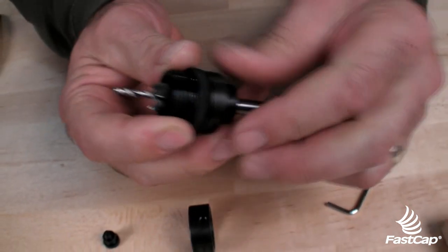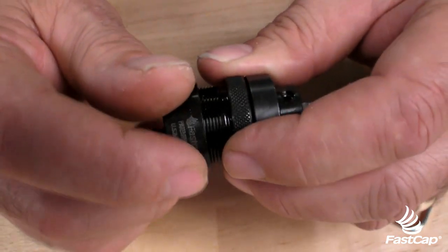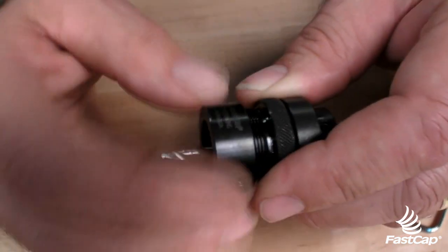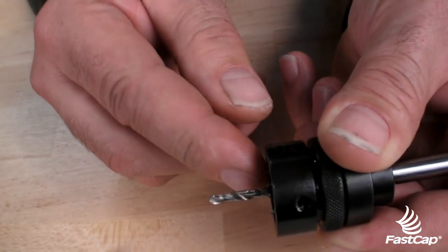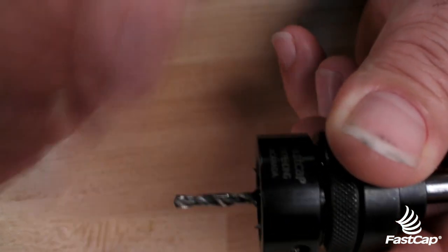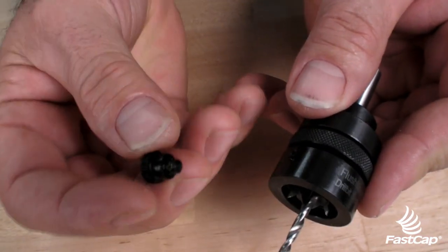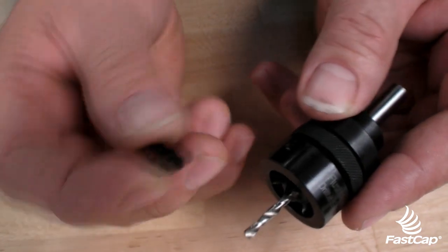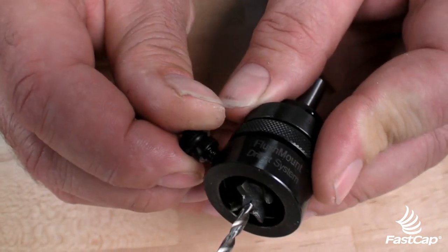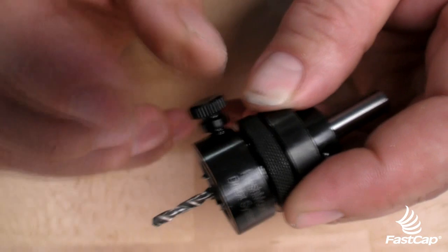The last part is the micro adjust, and that's these fine threads right here. There's a ball bearing system in here, and that's what makes this system so nice to use. We're going to take the stop collar and thread it onto there — it's nice and precise. We want to bring the collar so it sticks out just a little bit, allowing that carbide cutter to be just a little proud. It's very easy to adjust; it doesn't require an Allen wrench because we use this little plastic screw. If we bear down on those fine machine threads with metal, we're going to bung them up and our micro adjust won't work. So we just thread it in just a little bit.